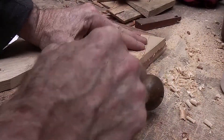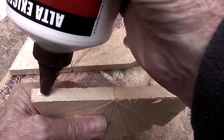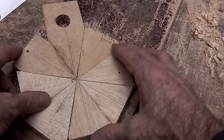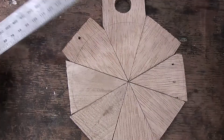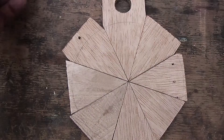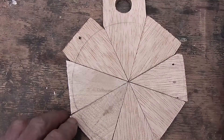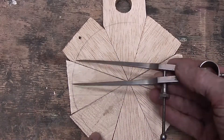Plane those two straight. If we have done everything correctly, we should be able to divide those into its eight portions straight down those lines. Then we can draw a circle from the center with a compass, to give at least a basis to then use some dividers to divide those quadrants into three.